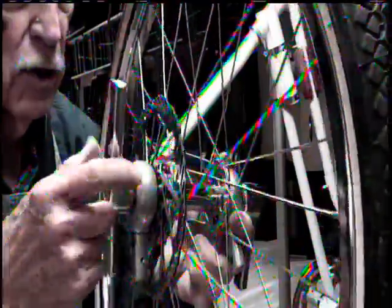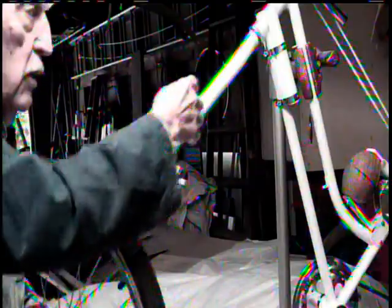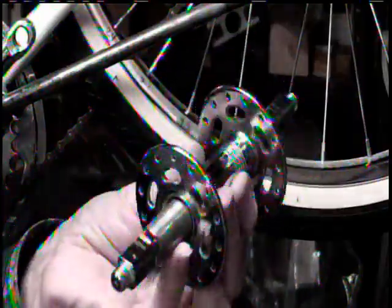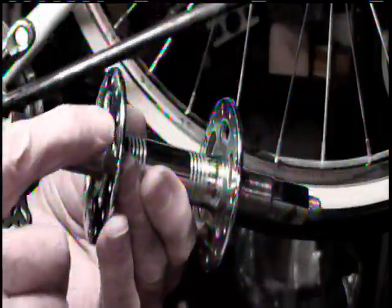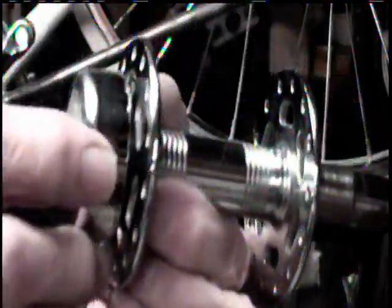This is a standard unicycle hub. Since it's offset, I set that axle up in my fixture to calculate spoke lengths, because they're all different lengths. This is a 24-inch rim and a 26-inch fork, which works out great — it gives you the proper clearance up on top, and the brake works quite nicely. I had to make little spacers to space the brake out away from the edge of the hub because of the spokes, and then put a spacer from there to the bearing, since the bearing can't go all the way up. We make little collar spacers for that.